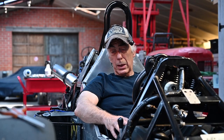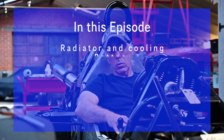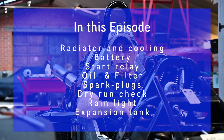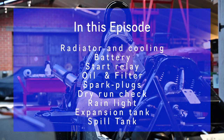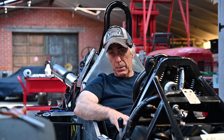Hello folks, welcome to the channel or welcome back. In this video we're going to continue to rebuild the Koenig race car. It's going to be a little bit of different things. In the previous episode we fixed the cooling system. We'll put cooling liquid into the engine, change some spark plugs, change the oil filter, change the oil — very basic maintenance. We'll also suck out the fuel and put a new fuel filter in, just to make sure I can get it running. Let's have a look at the cooling system and what we've done so far.